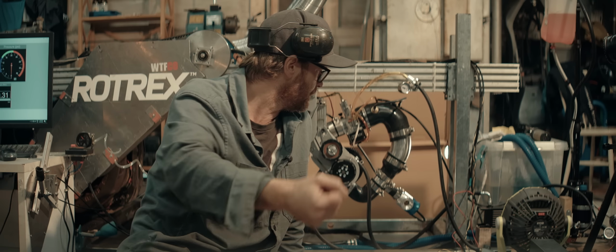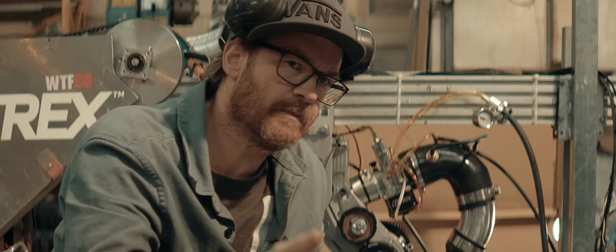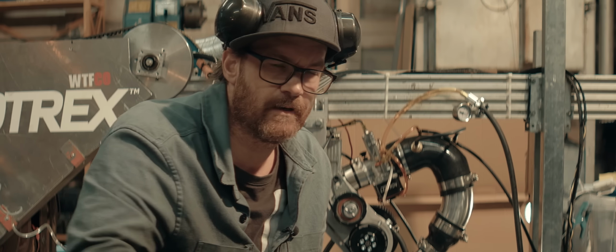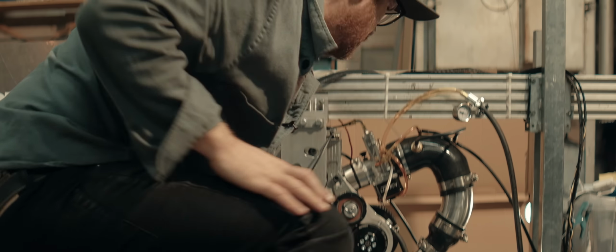When I get it going, I can't really hold it there, because there's no load on the engine. It'll just skyrocket. Impossible to get a feel for what's going on. I'm gonna hook up the chain for the retarder, see if we can still pull the engine up into the RPM range, and then we can start applying load and maybe start tuning it some.